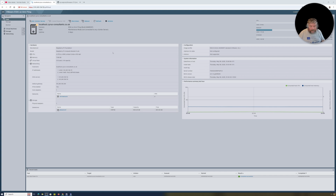I'm going to go and find that other CM5, and I must label these damn things, really, to be honest, because although there is a method for decoding CM5108000, the zeros mean that it's Lite. It's got no eMMC. 8 means it's 8 gig. 5 obviously is a Raspberry Pi 5. And the 1, I think, means it's got Wi-Fi. But don't take my word for that. But anyway, I really do need to label them up for the idiot in the room.